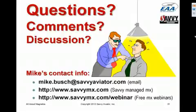That's right. Okay, David would like to know, is there a replacement for the dual mag on a Lycoming TIO-540-S1AD? Well, there is, but the problem is that you really can only change mags at engine overhaul. All of the Lycoming engines, I believe, have non-D versions, but they require a different accessory case, set up to mount 2 individual mags rather than the one dual mag. So it's not something you can change except when you overhaul the engine, and when you do, you can get a different accessory case installed, and the engine turns into a non-D engine.